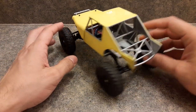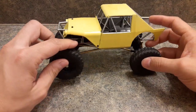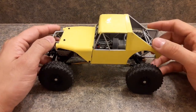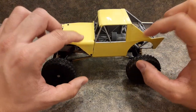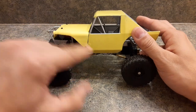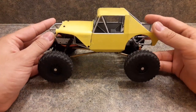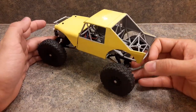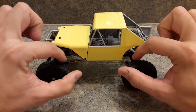If you wanted to mount the 130 or 180 motor it will be facing backwards, because I went ahead and put the battery tray in the front to put more weight forward. With the deadbolt version, the rear links are a lot longer than the front ones — that doesn't really work for the buggies. So I reversed the whole thing: longer links in the front and short ones in the back, which gives you the look of what the actual chassis is supposed to look like.